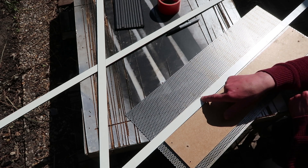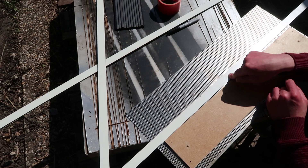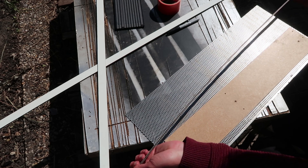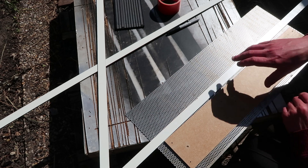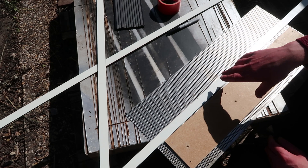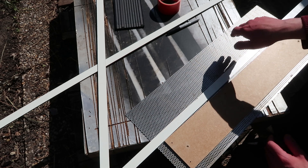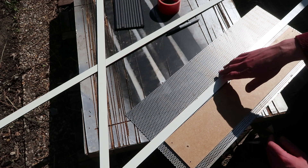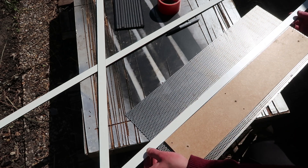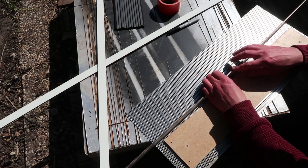Here I used a wood saw which is not ideal — I never used the HPL blade yet, but I bought a new blade for HPL so I must install it once I get new material to cut. I usually buy this HPL second hand for this kind of purposes, and I don't use the black stuff because the black stuff is nice looking and expensive. This can be cheap second hand since I'm only going to cut strips with it and the color doesn't matter much. So there's more chance of finding it in the thickness I want, which is 4mm in this case.